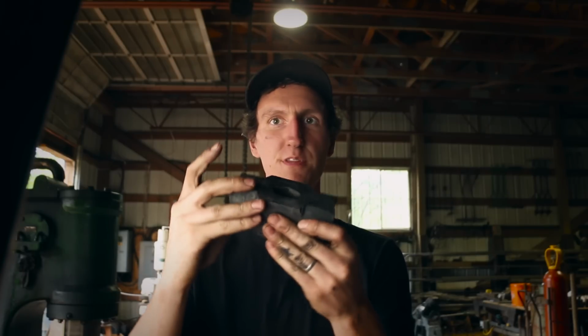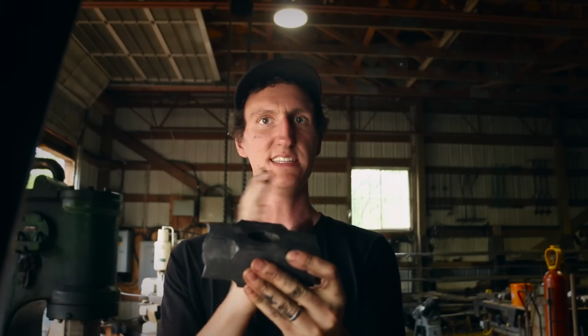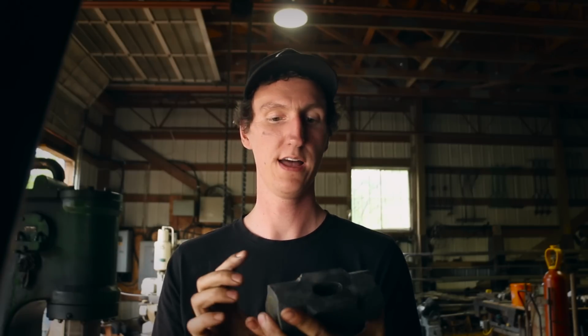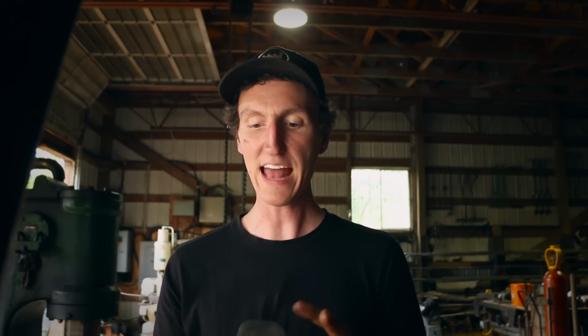Maybe I was a little bit crooked with the tongs when I came in and didn't set down the shoulders super square, which is weird because I had no problem with that in the past. Like on the one heat hammer, the small one, that wasn't a problem. So very disappointed about that.